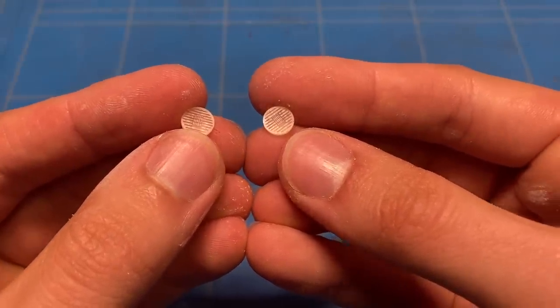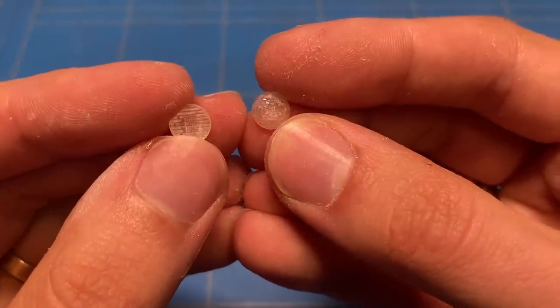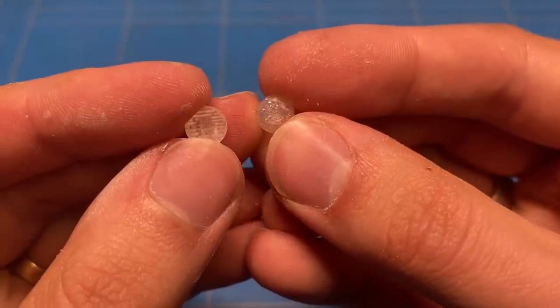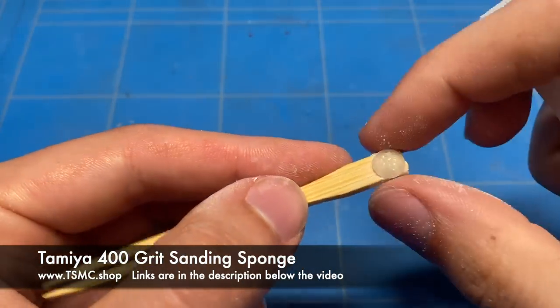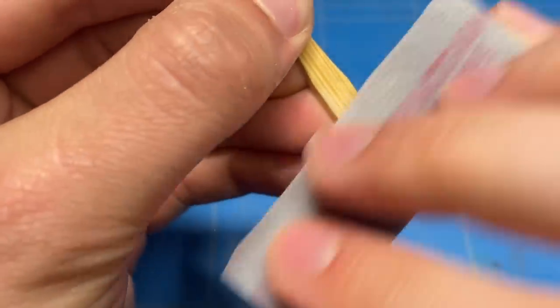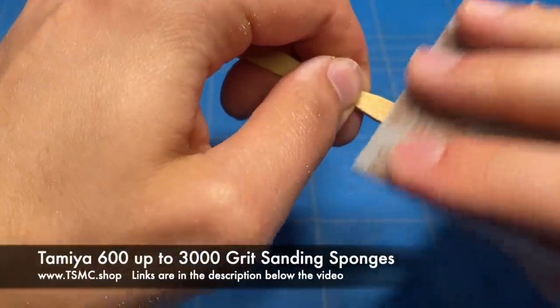Now, the inside detail was the most important for me, as I wouldn't be sanding that at all, and the outside domed pieces I added the supports to and decided to sand that and round it off as it should be, also originally already in the design, but depending on how you orient it in the slicing, you can simply decide where you want all of the supports to be. I figured this would be the best way to support it, as I simply needed to sand and polish it anyway.